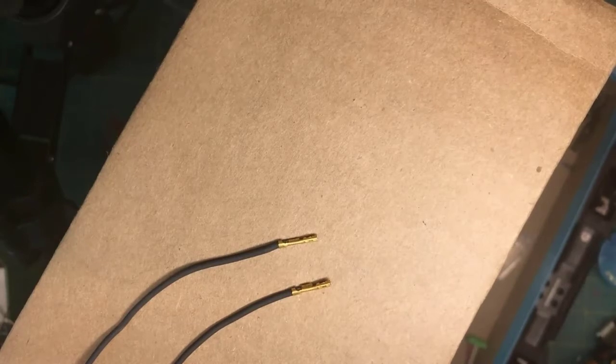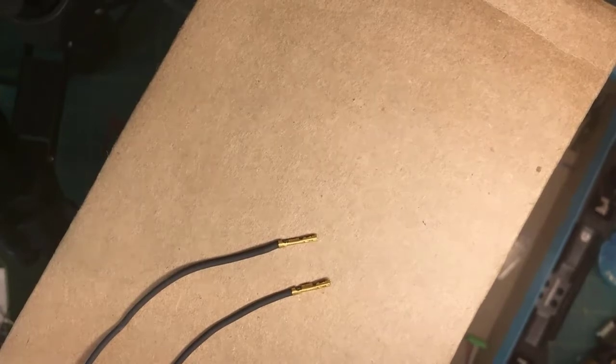Seth uses an ultrasonic cleaner with isopropyl alcohol to clean his boards. Thank you, I had not thought of that. But do remember, if you are using an ultrasonic cleaner with isopropyl alcohol, you better have good ventilation. So A, you don't kill what remaining brain cells we model railroaders have left. And you also have the problem of vaporized alcohol being a fire hazard. So yes, good ventilation. I do that with my garage door open. But that's one way to clean boards.